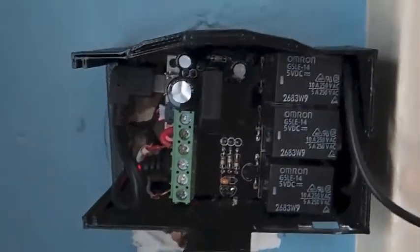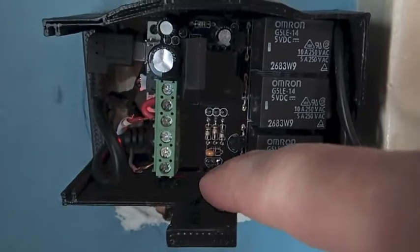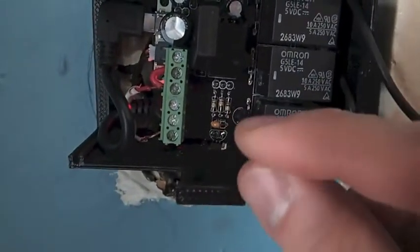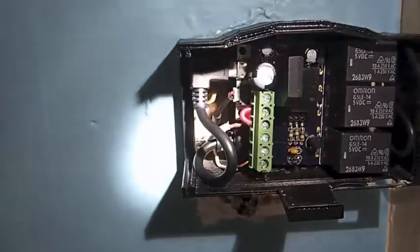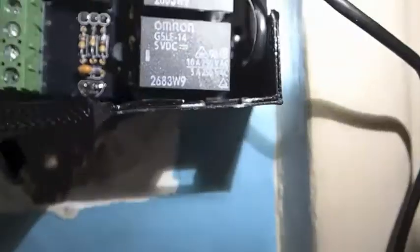It's a little tricky to get everything to fit in here just right. I mentioned already that I had broken off the micro USB on the Yo-Yo card, and I also just realized I broke off the thermometer on the board. So I soldered it backwards — instead of soldering it on the front, I soldered it on the back of the board. The way to do that is just rotate it so that the connections are still right. When putting the card inside the 3D printed case, it's a tight fit. You've got to make sure the USB is flat against the back, otherwise it's going to stick out too far and the top won't go on. I've got my wires scrunched up in this little corner.